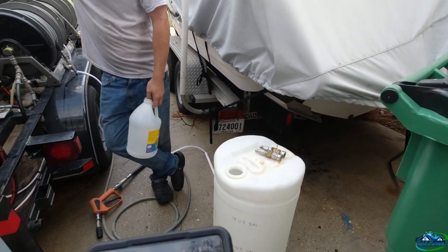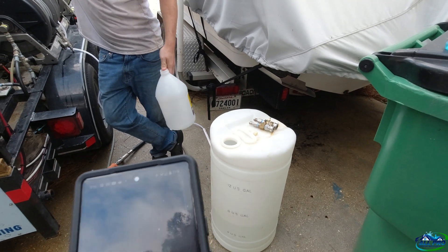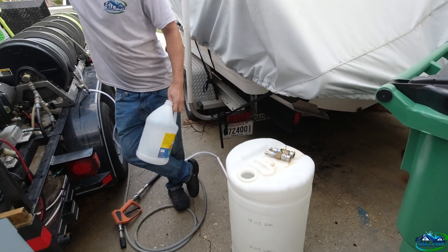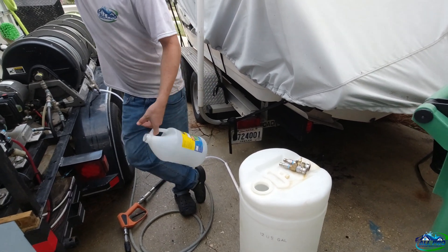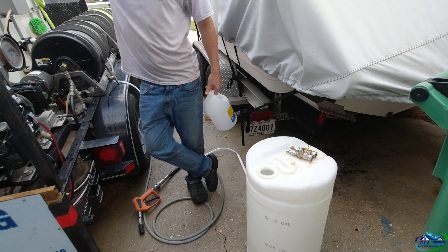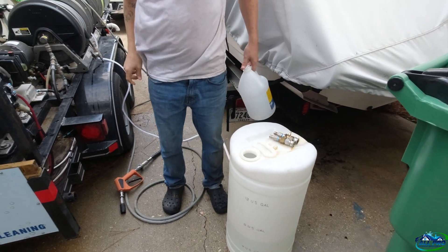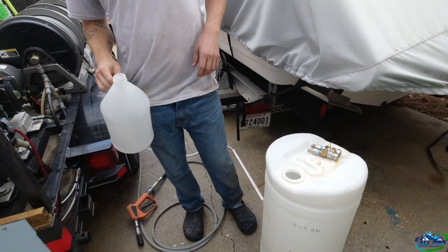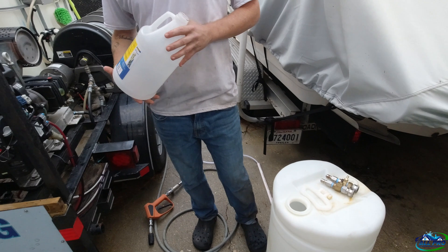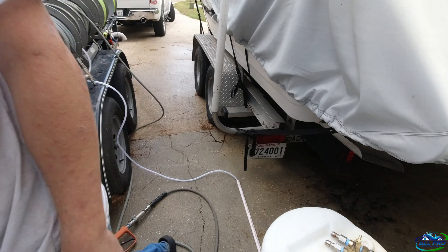Wow, that's stucco material — 2.08%. That's good to know. So we know where we're at: 2% with the 1.8, and 1.5% with the 2.1 — but with the 2.1 I lose a lot of flow too. In 60 seconds it was 4 gallons a minute. If we need it for stucco or stubborn surfaces, 2% out the injector is not bad at all.